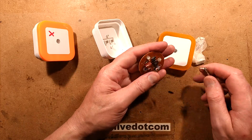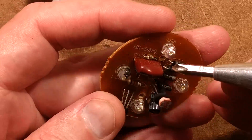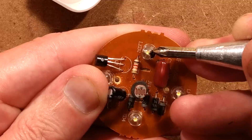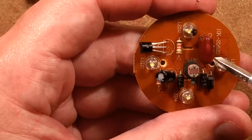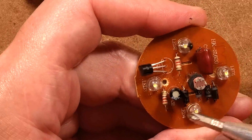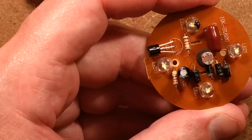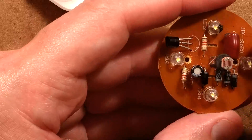Look at the tiny discharge resistor in that as well. Let's get up close and personal with this so we can see what's happened. Look at that tiny little resistor across the capacitor — it seems intact though. The capacitor itself has a skid mark and has left a big trace of soot up the side of the LED. So the capacitor in the dropper is the one that's blown up. These are typical nightlights with the incoming supply capacitor through a bridge rectifier, charging the capacitor up, and then a simple resistive bridge with this LDR — light dependent resistor — that when it's bright enough, turns on the transistor and shunts the LEDs.